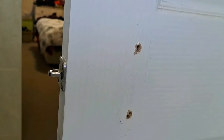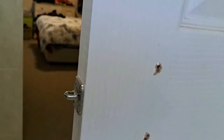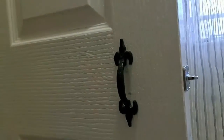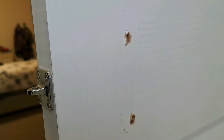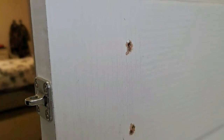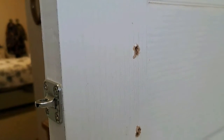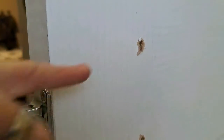I also have one other little problem: this is where one handle was — the screws stripped out of the door because it became too heavy to move. Every time the kids moved this handle up and down it wore out and stripped, same as this one. I'm going to take some wood filler, cover this up, and use some white ceiling paint. I'll put the handle back, maybe just next to the original spot.